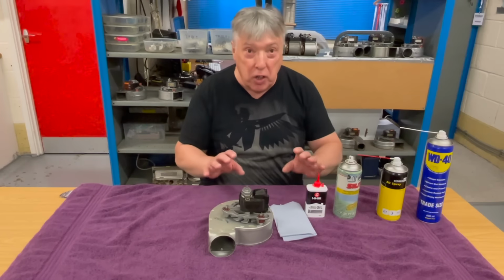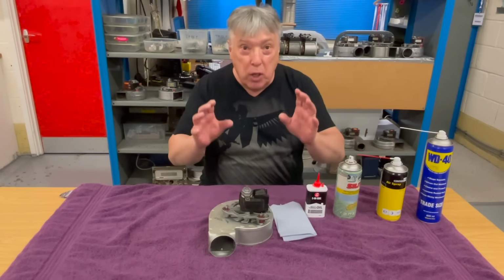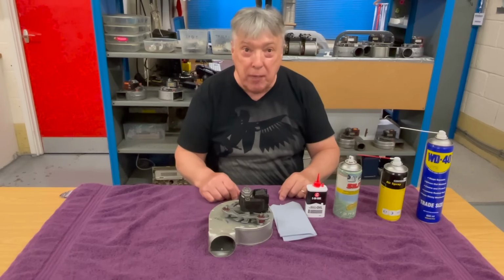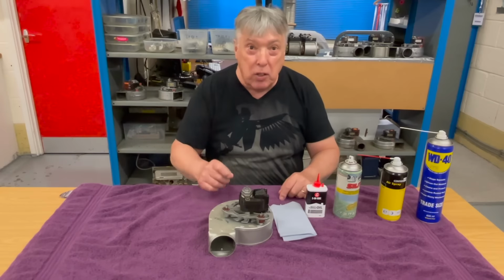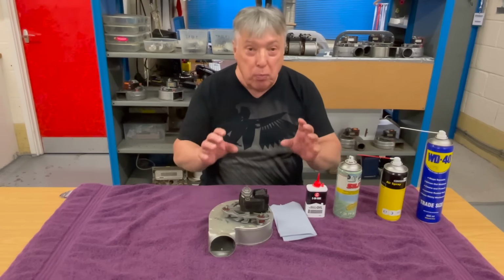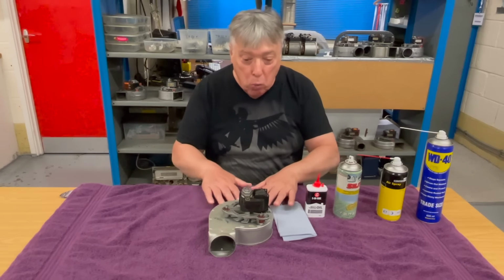So the procedure is, very gently remove the fan from the flue housing because it's easy to damage this, and when we spend half an hour cleaning, repairing and oiling, put it back into the boiler, switch it on, and it sounds like a tractor because it's now unbalanced. So always please be careful when you remove the fan to put it onto a nice worktop.